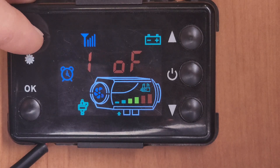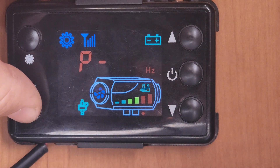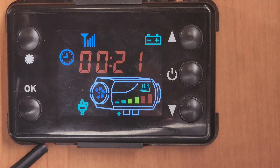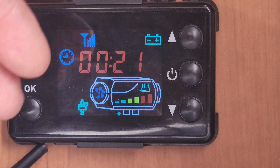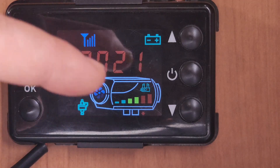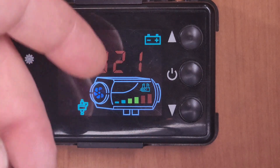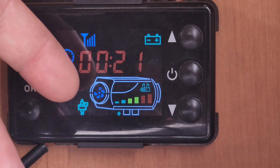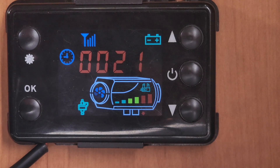Normally I have this set at a lower fuel rate and a much lower fan speed on high, so it's not so loud. So this has been running at 4.1 whilst we're talking. We'll go back in and drop it down to 4.0 and let it go back through the cycle. We'll let that do its thing — it might take about 30 seconds to a couple of minutes depending on what yours is set at. If you really want, you can go down by 0.2 at a time, but be mindful that when you come out of the settings it will drop out of the red lights rather quickly. You will use far less fuel once you tune it properly.